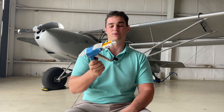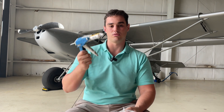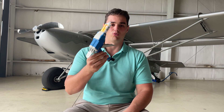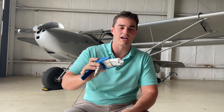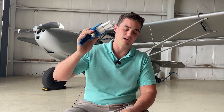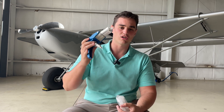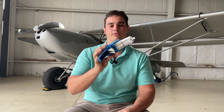This tool saved me probably many tens of hours of work — not just in dispensing and mixing the hysol, but also in cleanup. When you have one of these, you spend a lot less time masking and cleaning up and dealing with solvents. So that's why it's tool number one for me. If I had built the plane from the start with this, my fillets would be a lot better and it would have saved me a lot of time and energy. Definitely a must-have tool. Even though I broke one, for 25 bucks it's still well worth the spend.